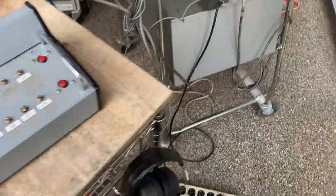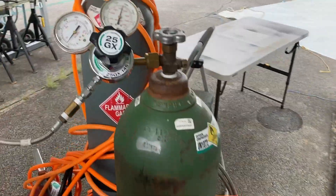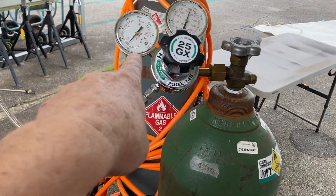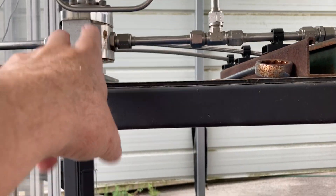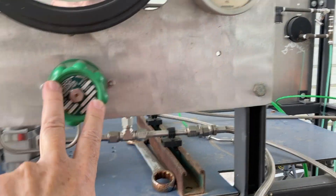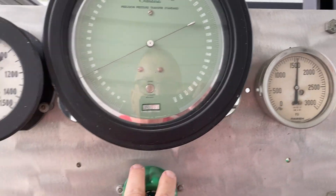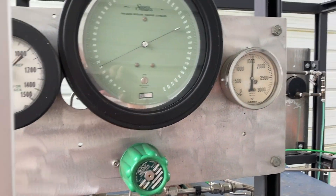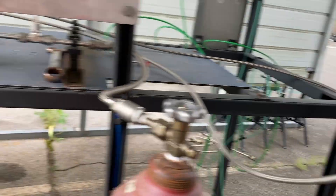Our control systems for the gases are supplied by K bottles. We have the oxidizer set at pressure with a regulator here, and the fuel is controlled by a dome-loaded regulator, loaded by hand. We have our supply pressure in the tank and we can set that pressure with the dome loader to provide the proper choking arrangements. The nitrogen is set at a reasonable pressure for purging.